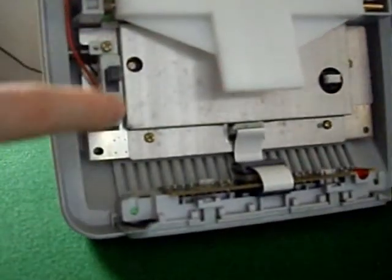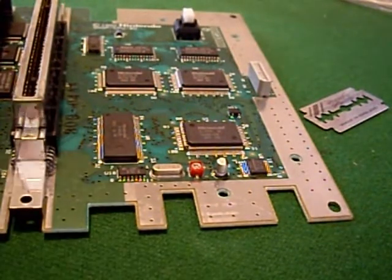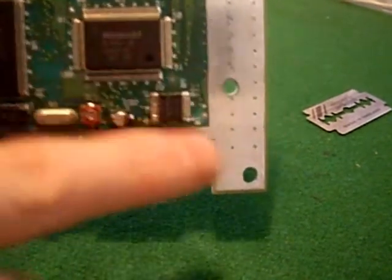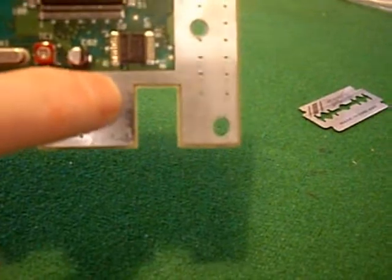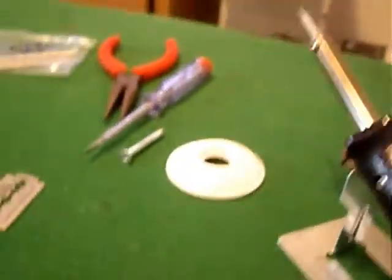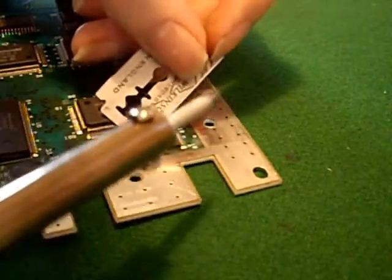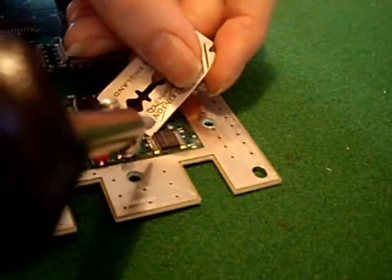I'm going to gut this out more until we can get to the main board. Normal Phillips screws now - dead simple. We're down to the board. This is the chip we're going to work on first. You can see how tiny the legs are. We're going to lift two legs - pins 1 and 2 here, and pins 10 and 11 on the other side, as marked on the board. We'll do that by heating with a soldering iron, a bit of braid, and a razor blade. Try not to cut yourself with the razor blade, burn yourself with the soldering iron, or burn the board, capacitors, or chips.